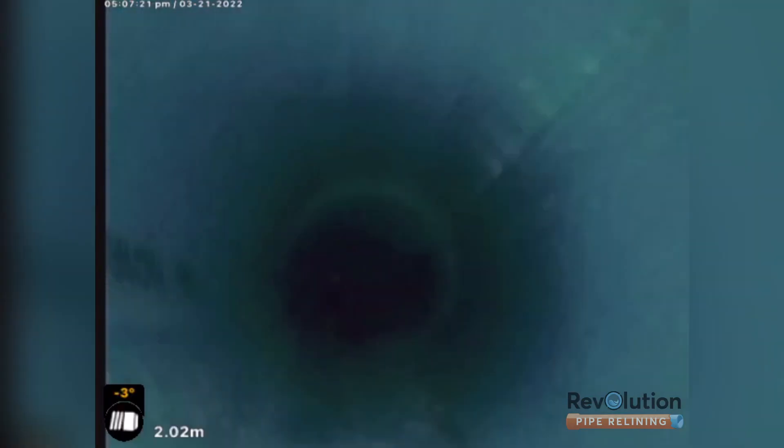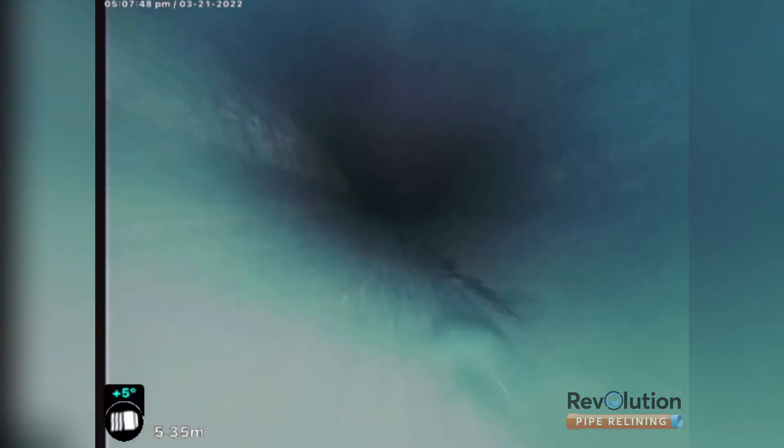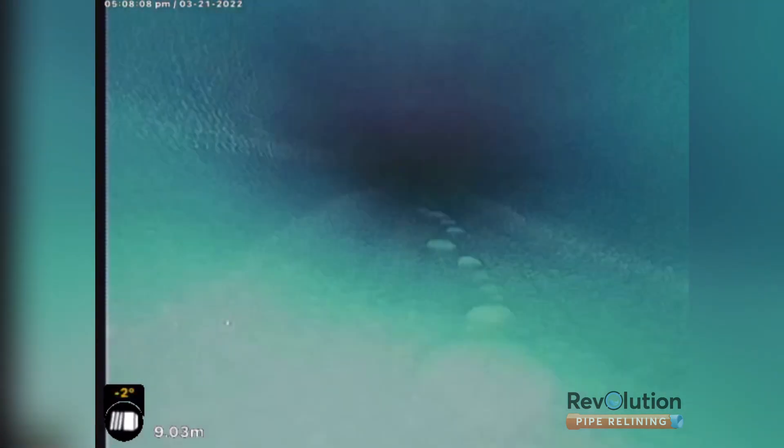Okay, down through the toilet hall. Junction cut on the right, small inspection opening hole on the top using the IMS cutter. This starts off in 100mm, straight after the dropper on the toilet line. It expands out to 150mm and runs downstream to where we excavated a collapsed boundary trap and reinstalled that in PVC, then lined right up to overlap our new PVC on the edge of the 85mm junction.